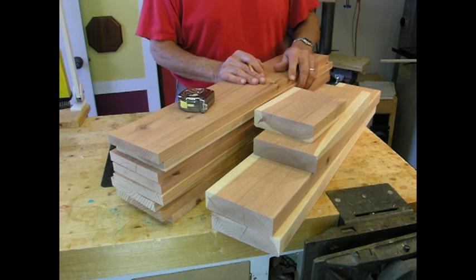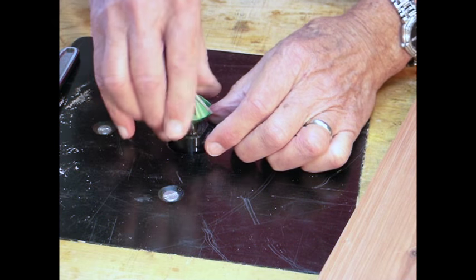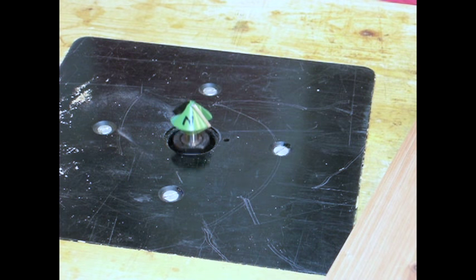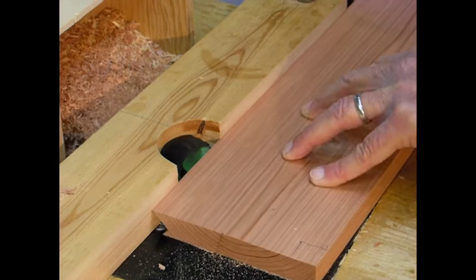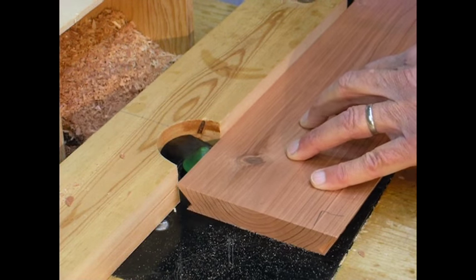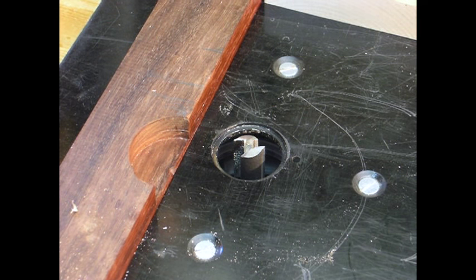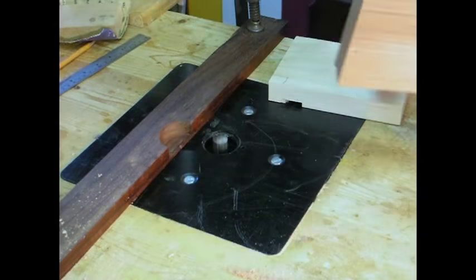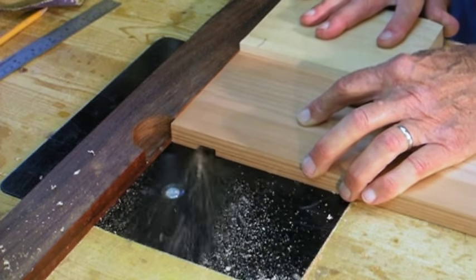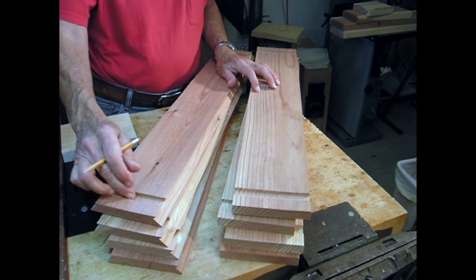I will describe both the short and the tall stands. I'll do the birdmouth joints next. If you are not familiar with this type of joinery, you might find my introductory video helpful — there is a link to it below the viewer window. We're using the eight-side bit, and I'm going to put a V-groove on both sides of four staves and leave the other four untouched. The bit height is set at just a shade over three-sixteenths inch. The eight birdmouth cuts are completed. Now let's change our bit to a three-quarter inch square and cut the grooves needed to hold the barrel ends in place. We'll cut these grooves one-quarter inch deep, one on each end of each stave, one inch from the end.